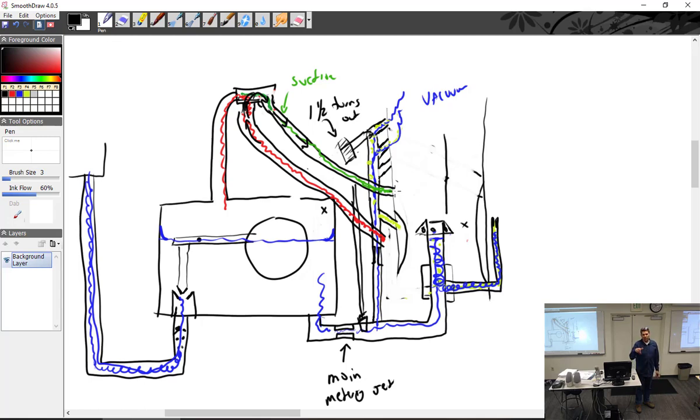So why not start by just backing it out and getting it out of the way? It's very frustrating when you go to get in an airplane. You get it all set up, you get in, you start it up, and the idle's so high that you can't do anything. You just wasted a bunch of time. So you have to shut it off, get out, and back the idle down. Why not just back the idle down to start? Take the screw, back it all the way out so it doesn't affect anything. Do you follow? Yes. We're mechanics. Get it out of the way. I've got work to do. You can't set the mixture if the idle's too high.